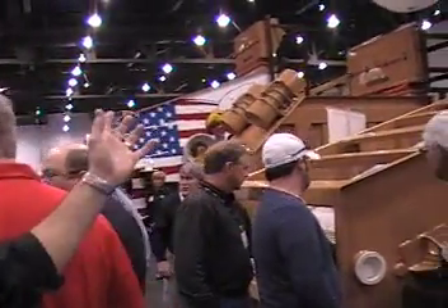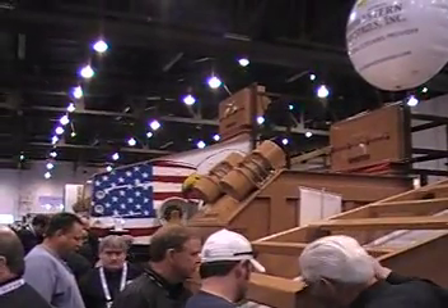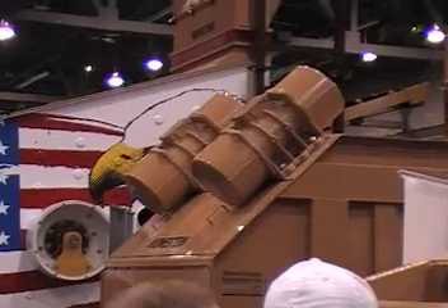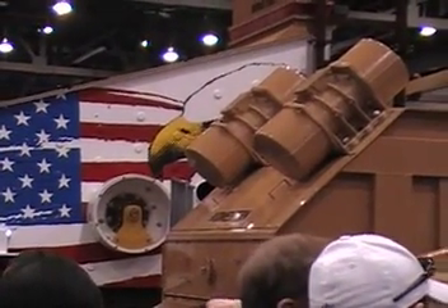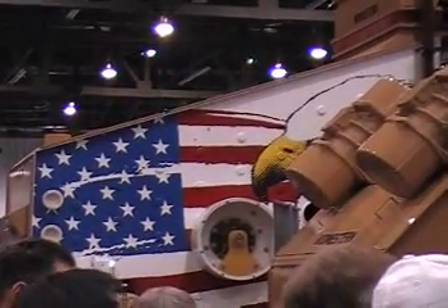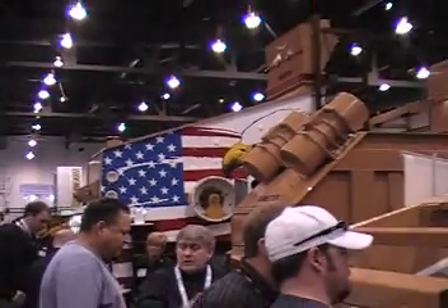As we move throughout the booth, you'll see that we have in the middle here a multi-vibe — it's a five-deck unit that is also used to do frac sand, finer screening. And then at the end here, we have our 5x10 5-deck, which is also in the field and you can do six cuts and six different products.